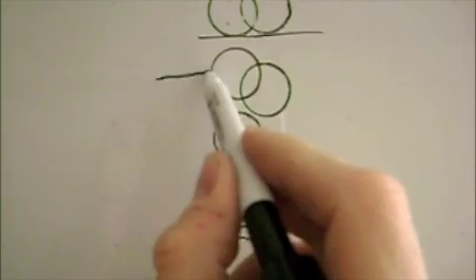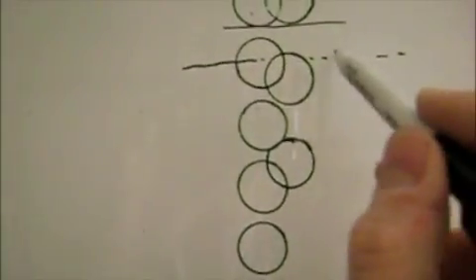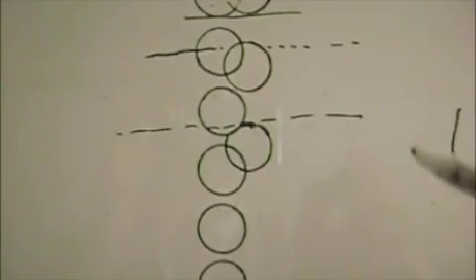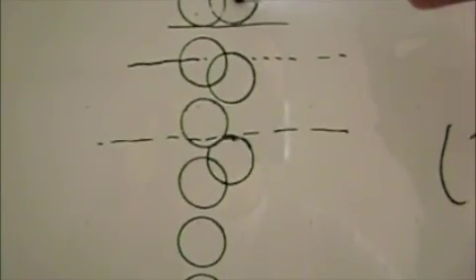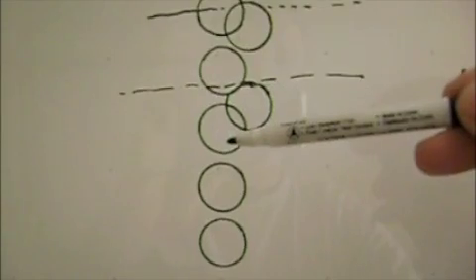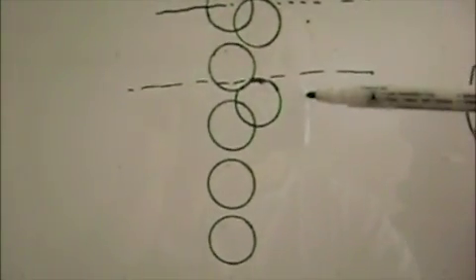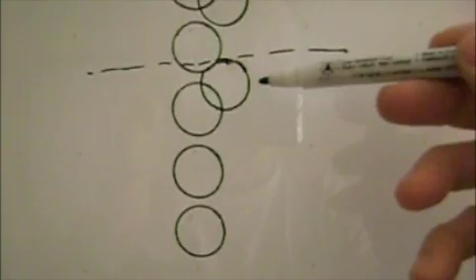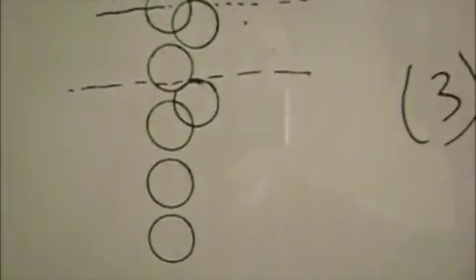This is kind of tentatively called the golden ratio. The next set should line up at about the half point of the magnet, and the third set should be off here. In other words, there's always going to be one magnet at 100% repulsion, one magnet at 50% repulsion, and the other magnet being drawn into the next magnetic field. So the full strength and half strength here are greater than the strength of the field trying to repel the rotor from bouncing into the next pattern, in theory giving it enough force to maintain rotation.